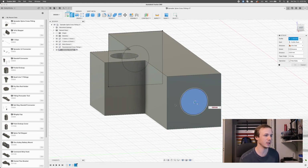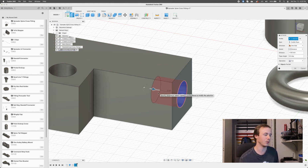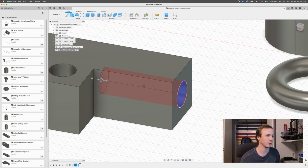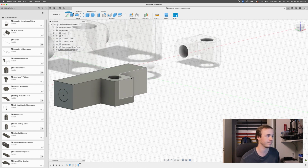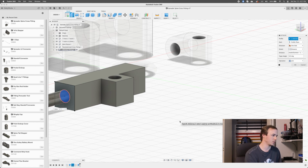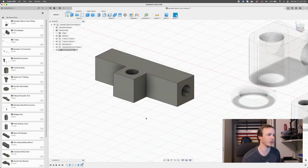This guy, I'm going to hit E and extrude that. And instead of pulling it up like I did before, I'm going to push that in. Right? And now we're making a hole. And we had decided that the hole length was going to be spreader diameter times 3, right? But that's pushing it out, right? I need it to be a negative number, so I'm going to multiply by -1 as well. There we go. So now we have a hole that goes in just the length of this guy. And we'll do the same here, spreader diameter times 3 times -1. Right? Cool.